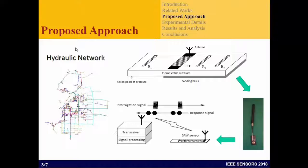A simple approach for us is: the SAW sensor has designed IDTs and transducers. Through the transducer, embedded with antennas, you design the reflectors — a three-reflector design. One reflector looks after pressures, two compensate for temperatures because they are related. This is a small manufactured device linked to Harbin Institute of Technology, who developed something along these lines. We used this to characterize whether it could be used on the water pipe.